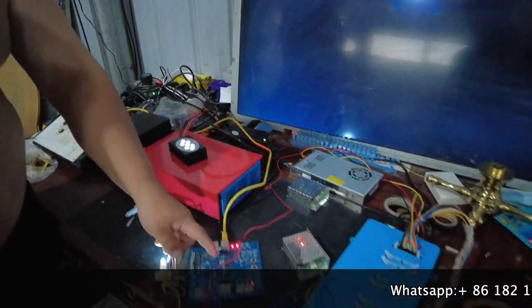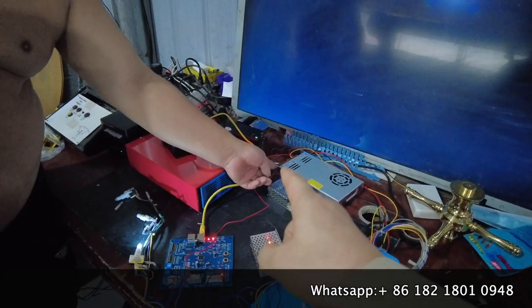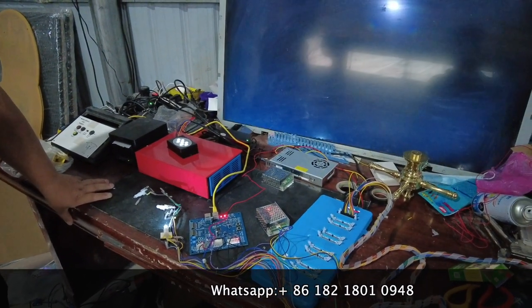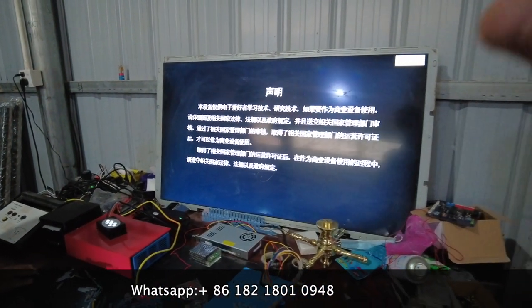On this floating board, the red cable must be connected to 5 volts — it cannot be 12 or 24 volts, it is only supposed to be 5 volts. Right now we are restarting the game to see what happens after we set the refund type to coin.